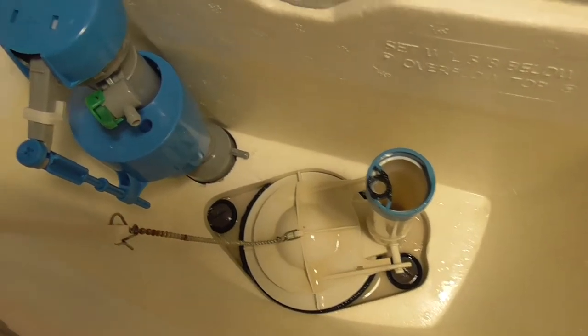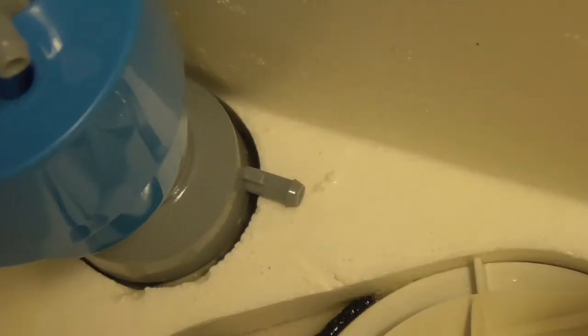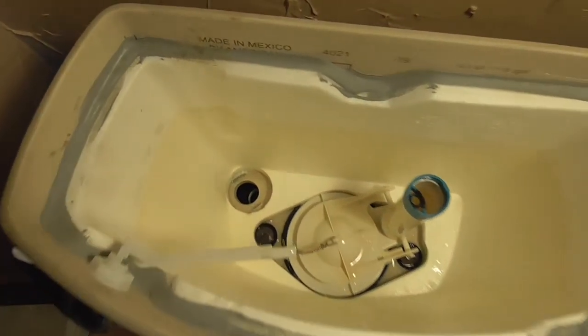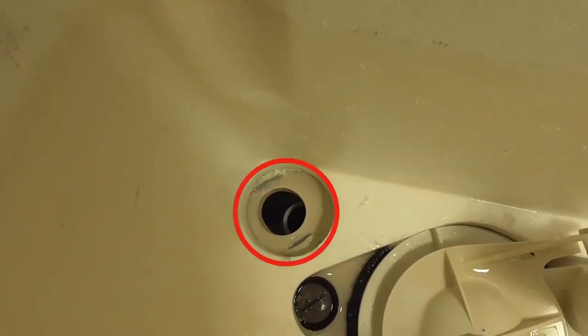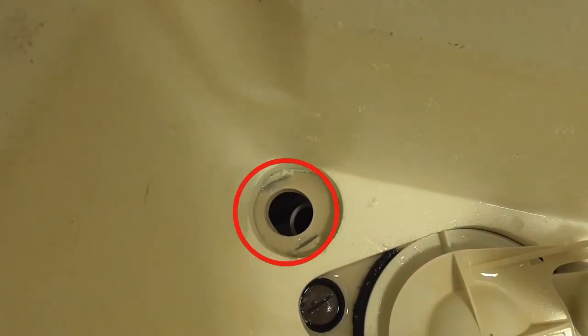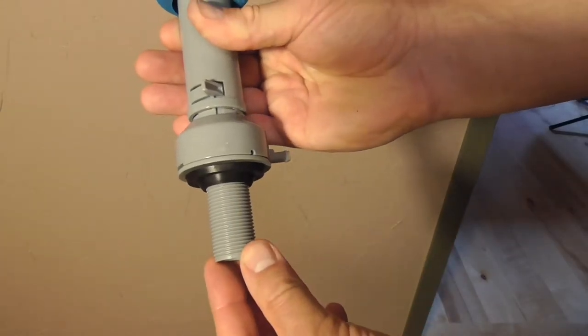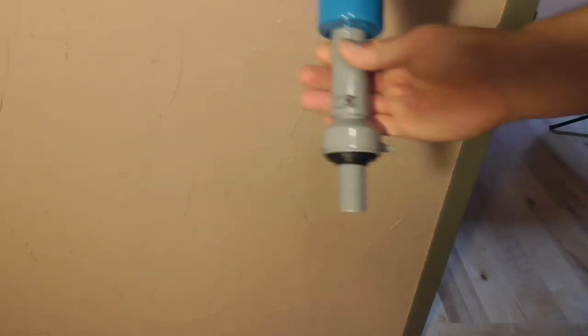First, the foam will need to be trimmed to accommodate the main water discharge port and tube. Second, the hole in the foam insulation in this tank is for some reason positioned off to one side in relation to where the valve is to be bolted in. With the new valve having a thicker base compared to the old valve I had previously, my tapered rubber washer would not sit centered in the hole inside the tank, which would definitely result in a water leak.